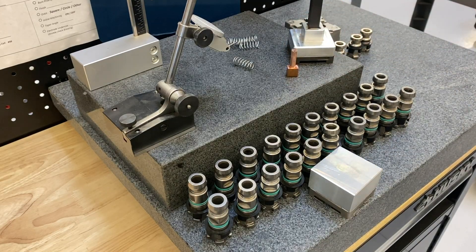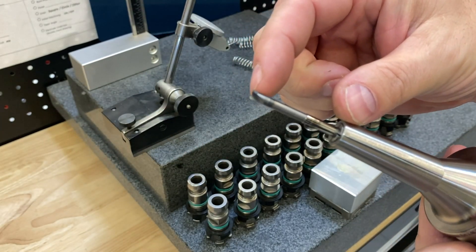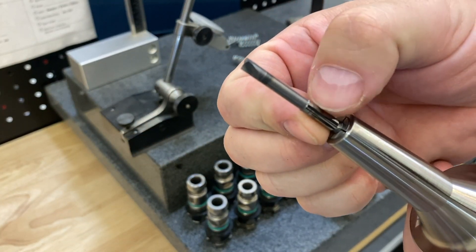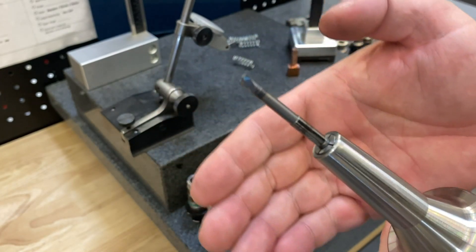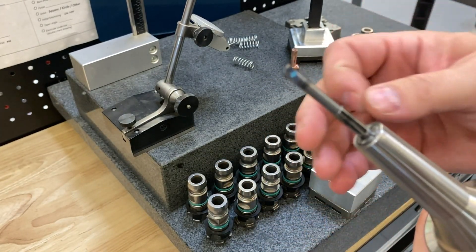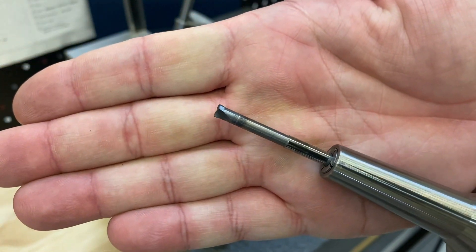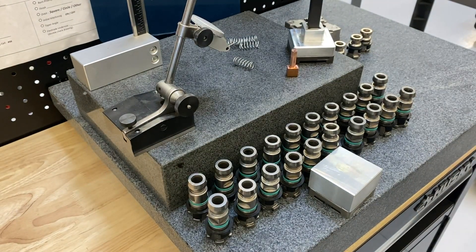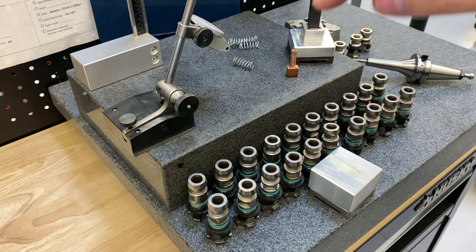It's out — it's clean. I ended up milling around it. Because of the nature of the feature, I was fortunate to use one of these Lakeshore Carbide high-feed end mills. Look at this stick-out — not only the stick-out of the relieved portion of the end mill, but look at how much of the shank you can see. I was getting some rubbing on the hole and I knew that, but I had to allow it to avoid making the feature oversized so it could still be finished. I called a buddy of mine who used to work for Mitsubishi and he said, 'Jason, you're going to have to do surgery if you want to get that out the way you want it.'